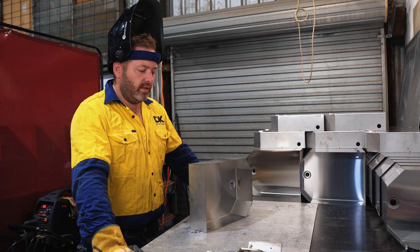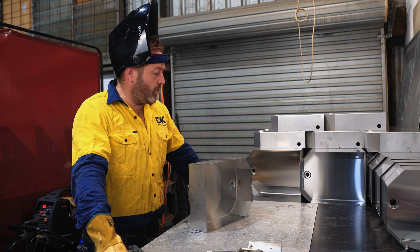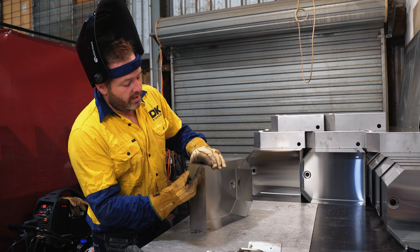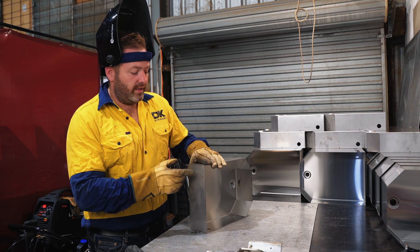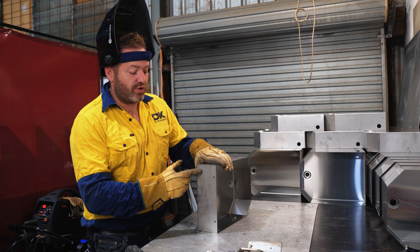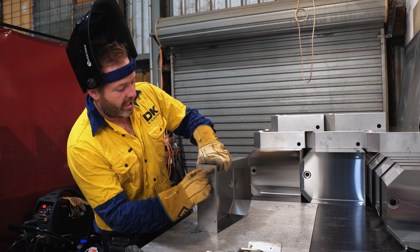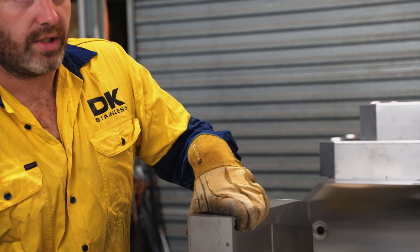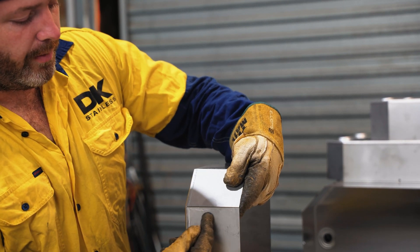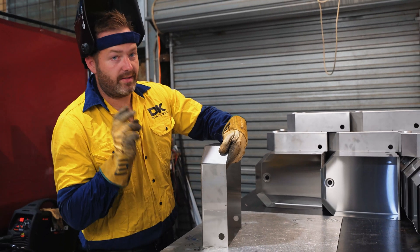When it comes down to welding, obviously PPE is key — gloves and a helmet. If you don't have a helmet, don't weld. Now, before you start doing the weld, because we are wanting to do non-penetration, the joint of what we're actually welding is crucial. You won't be able to do a non-penetration weld very easily if it's not literally touching — if it's not a perfect joint. As you can see here, you cannot see daylight, so literally it's just going to be fusing. Same along all of the corners — every point to be welded is touching, and that's actually key.